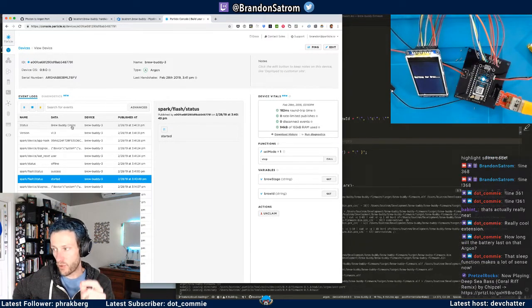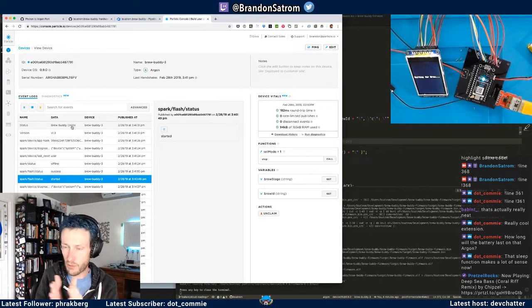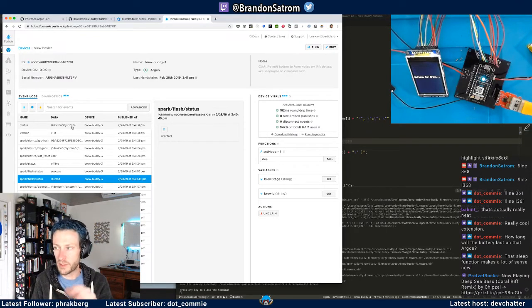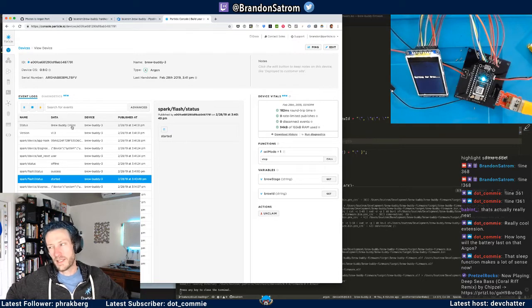And then when it gets to that point, it'll wake back up and start reading and connecting to the device cloud. Another feature that I want to add is as the fermentation rate slows down. When fermentation first starts, it kind of picks up speed a bit, and then you'll have active fermentation for a day or two, and then it'll slow back down. And when it slows back down, I want to put the device back in sleep mode. So fingers crossed, I would love to be able to run on a single battery for a week. Maybe that's crazy.